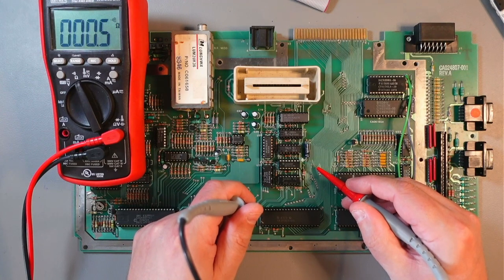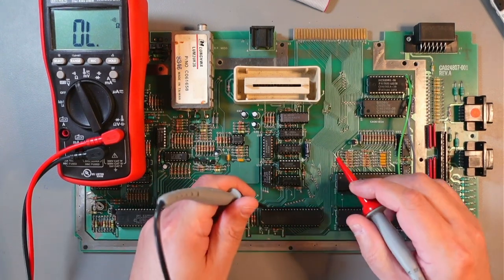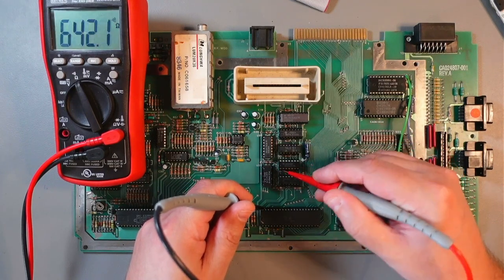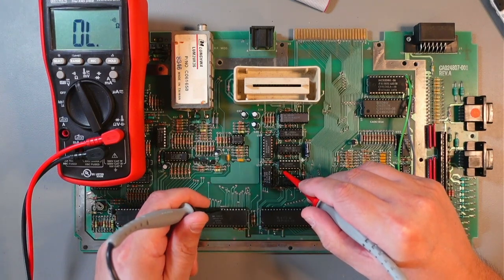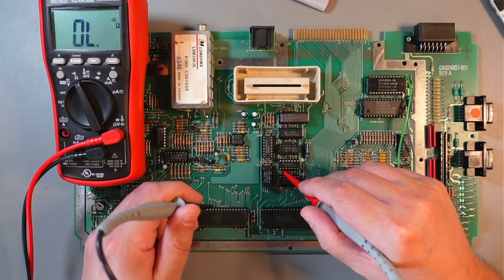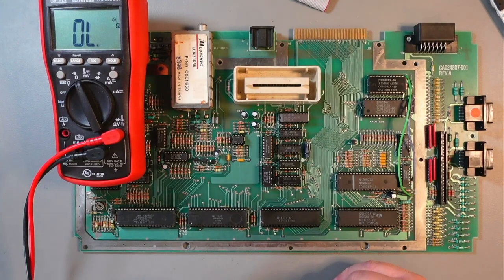And you see there. Then 39 is that clock signal, but that clock signal actually goes right here to one of these chips, and then to that pin here, and from there it goes to Antic. Antic is right here and is, I think, 29. Which one was it? It should be... Yeah, this is Antic. Let me have a quick look.